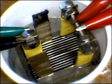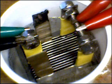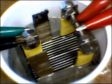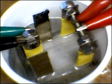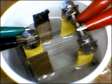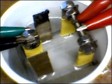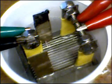Alright, now what you see in the picture is a couple of shims that I've inserted between the positive electrode and the next adjacent neutral plate. So what I've essentially done is I've shifted the energized electrode in one plate, and now I only have 5 neutral plates instead of 6, and 6 plate cavities in between the electrodes. I'm going to bring it back down to 12 volts or 14 volts, 13.8. And with 13.8 to 14 volts, we have approximately 2.3 volts per cell. And when I plug it in and energize it, you can see that distribution is very even.